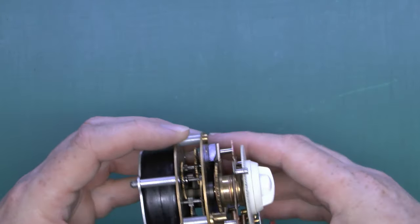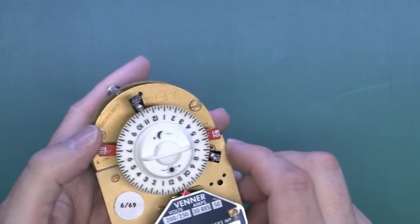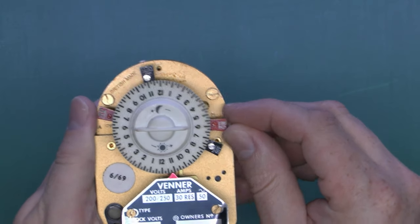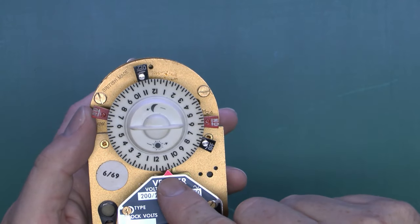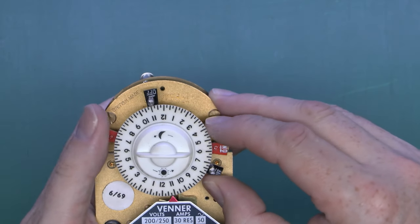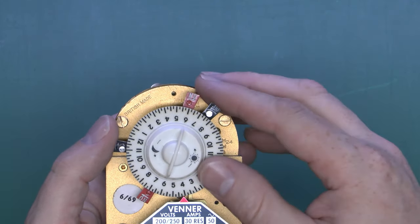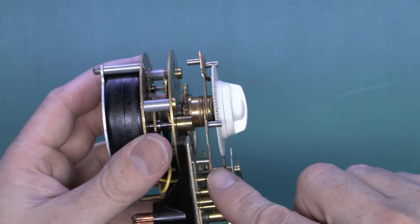So it just goes in the front there like that. That whole black piece is basically a motor, and then it comes through to the front here. You've got the various gears and other mechanisms there to reduce the speed down, so it's essentially one revolution per 24 hours. To set the time on these, it's essentially these black and red levers here. The current time is indicated by this little red pointer - so this would be just after 11 o'clock in the morning. The direction of rotation is in this direction, and in this case it's set to come on at about 6:45.